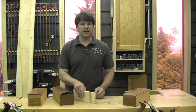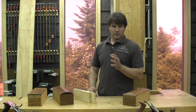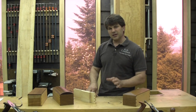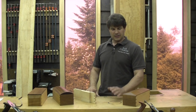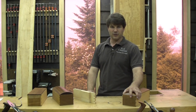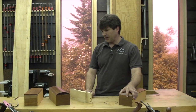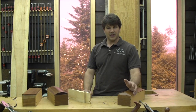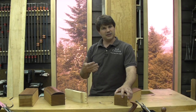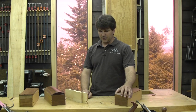We're going to use northern white pine, and a lot of people criticize or don't like pine, but I think it's a fantastic wood. It's very easy to cut, very easy to plane. It probably ages better than any other wood I've ever worked, including cherry — because cherry will tend to fade out with enough UV light, whereas pine just keeps getting that deeper and deeper honey patina. I have a lot of children and it's inevitable that furniture I make is going to get dinged up. With pine, that actually enhances the look, whereas in hardwoods it looks terrible when they start to get beat up.